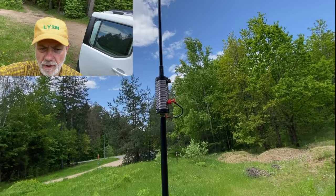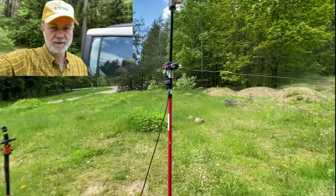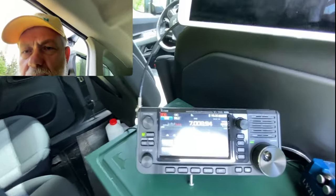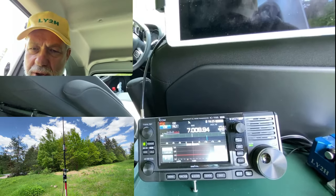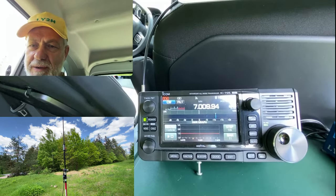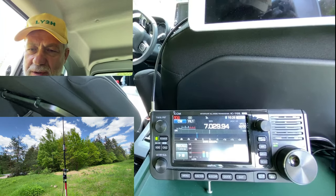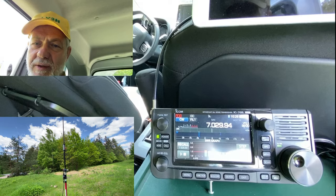All right, so the antenna is set up and the counterpoise length is adjusted. Now let's see what we have in the SWR field. Okay, we measure. Let's measure the SWR again in the CW segment of the 40 meter band. We see that basically the whole CW segment is covered by a very good SWR, around 1.5 or less.